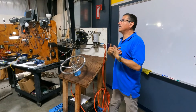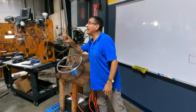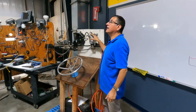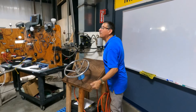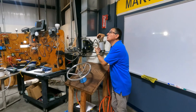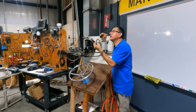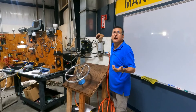What is the meaning of that? If I am the owner of the boat, the captain or the engineer, periodically I need to open the hatch and verify that this gauge in the power steering system reads 25–30 PSI. If the pressure goes down, you have a leak, and you need to identify in what part of the boat the leak of oil is. This is why I recommend using hydraulic oil with a different color to identify easily where the leak is. Those clear, transparent hydraulic oils are not good for me, because in the boat it's difficult in the bilge to identify where the leak is.